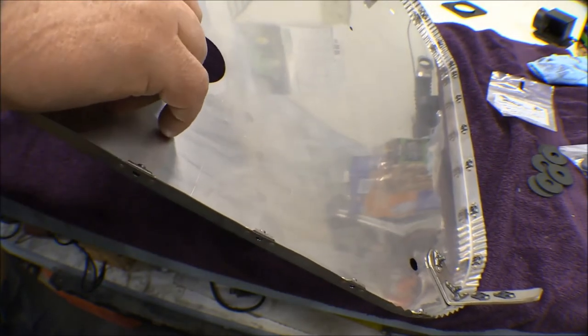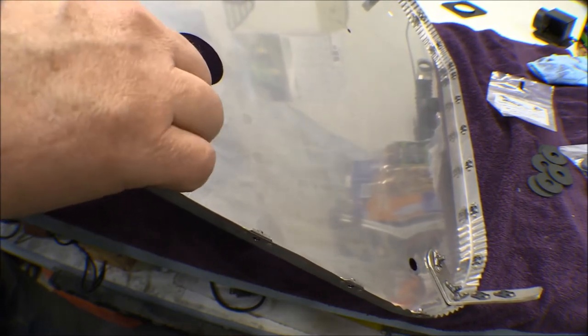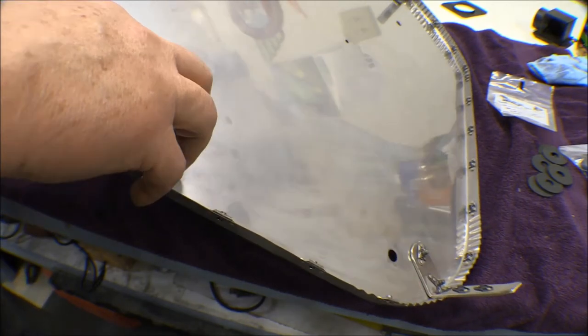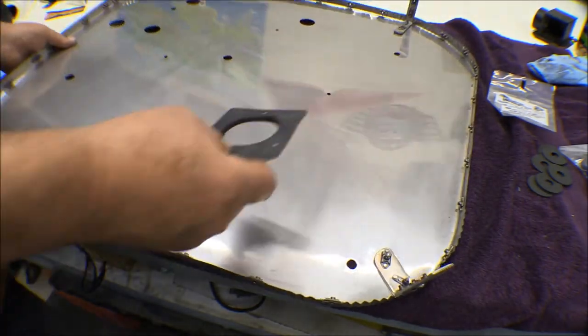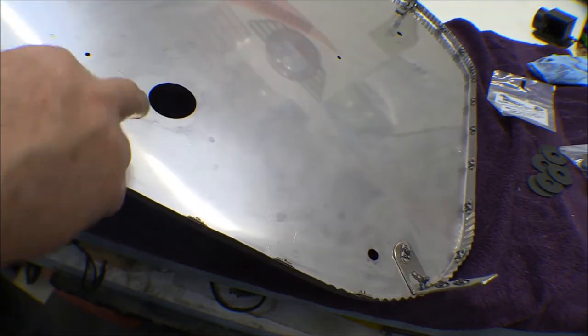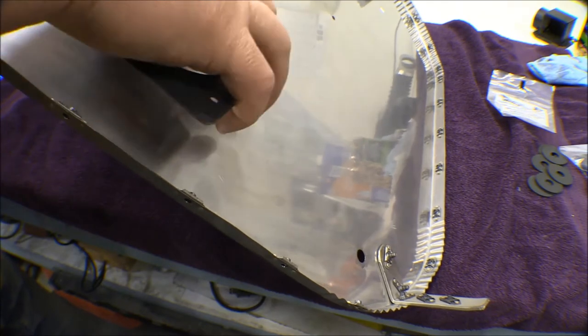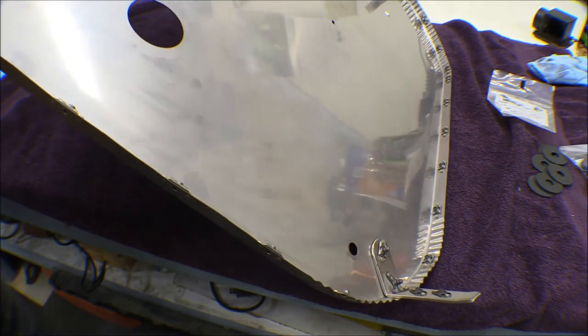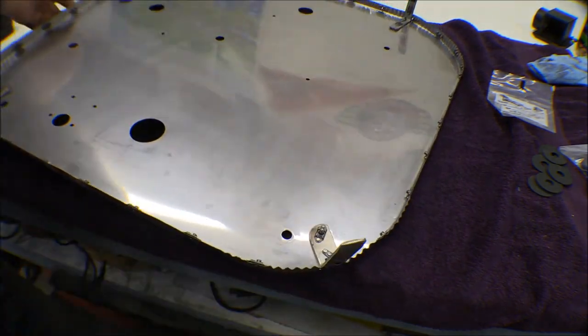But it's not scratches, it's just places where there's dimples. Well, getting to looking at it, this is where the cabin heater mounts and these are the holes. Here's the trim piece that goes on the inside for the cabin heater and so those holes are located in there for the cabin heater mount. They must have different styles of cabin heaters because there's holes punched in different places. This takes the old style cabin heater, takes three holes — one in the center on the bottom and two up here — and then this one also has four holes out here in a square pattern. Anyway, those holes are located on there kind of like finding the location for the holes for these cowling mounts.